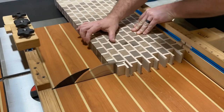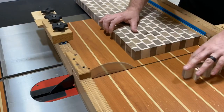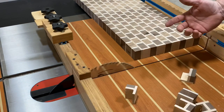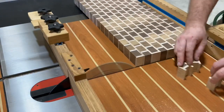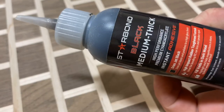Now to the crosscut sled — we're going to cut off some of these pieces that really don't belong there. I didn't cut quite far enough; I left too much maple exposed. That doesn't really give you the best effect. I'm going to flip it over and do the same thing to the other side, and then later I'm coming back to cut off most of that maple, exposing most of the walnut on the sides, just like there is on the top and bottom.